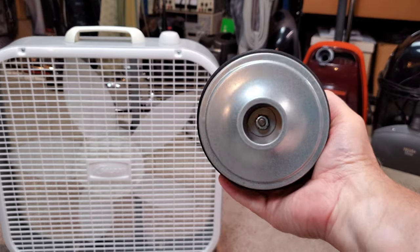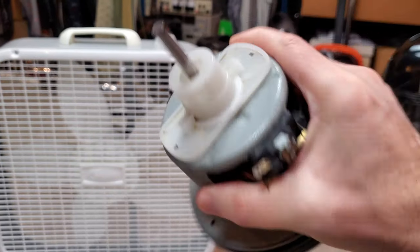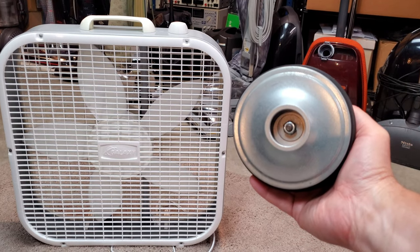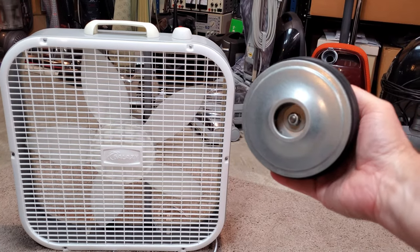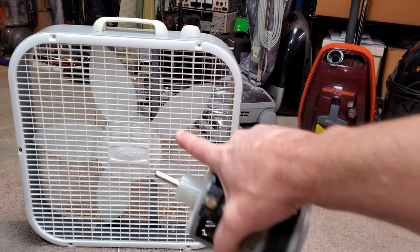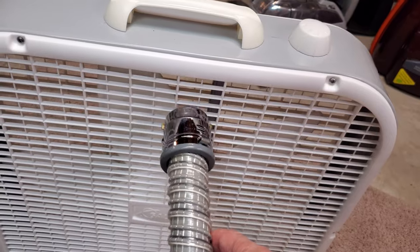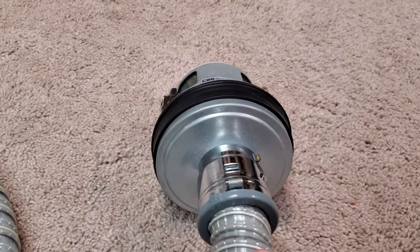The airflow that goes into this hole comes out of these holes in the back. It's actually fairly similar, but the entire design is completely different. This generates a huge amount of something that the big open-air box fan doesn't. Even though they have similar airflow — lots and lots of CFM — the box fan has essentially almost no suction, and you can't hook a hose up to it. So you need to take some of the airflow and get it to go into a hose. With this smaller unit, you can. That's the same general idea.